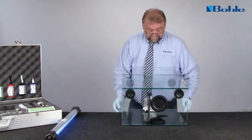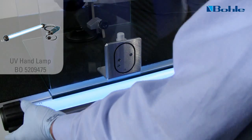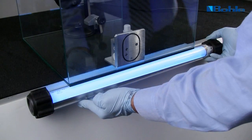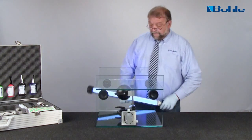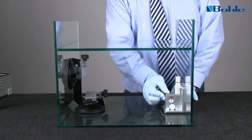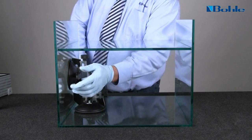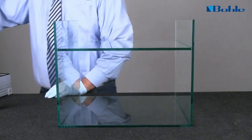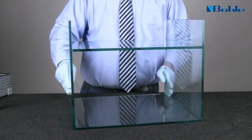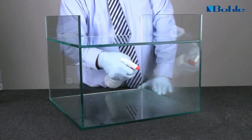During the entire process of curing, pay attention to the right position of the lamp. The adhesive is now strong enough for the object to be handled. Excess adhesive is still pasty and the fixation devices can now be removed. Excess adhesive is removed with a cleaner, blades or steel wool.